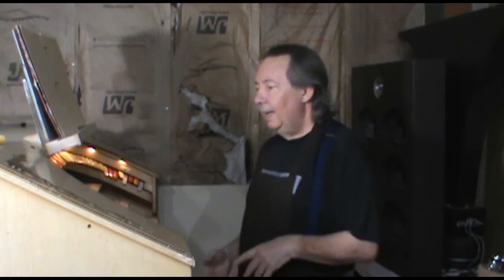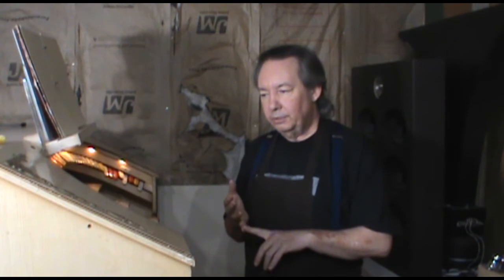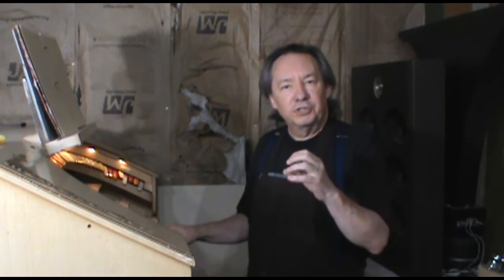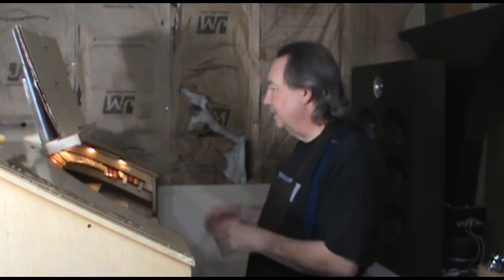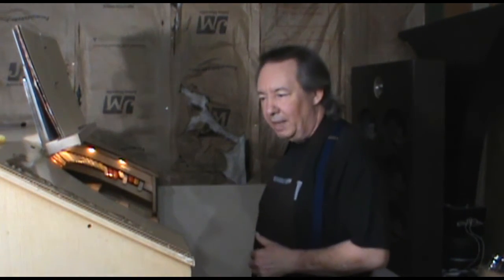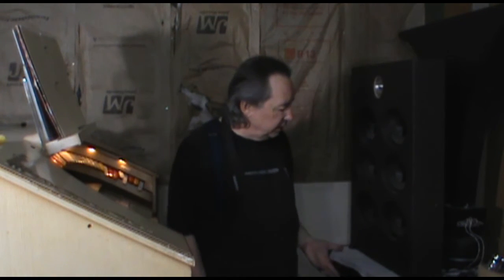And there we go. The volume pots on the output panel are dirty and scratchy. And the problem with that is, of course, you get your volume adjusted just right, and then, well, there's a little piece of dirt just sitting there, and the next time you turn it on, it's interfering, and then you got another problem. But hey, we got the Leslie back running. We don't have any unwanted noise issues. Everything seems to be coming together very nicely.